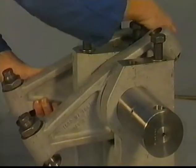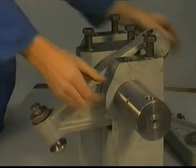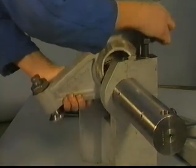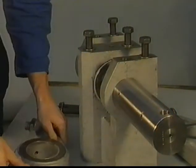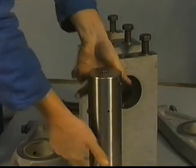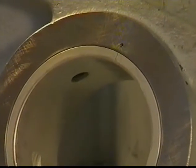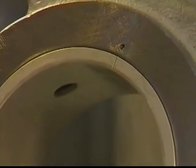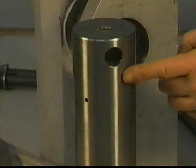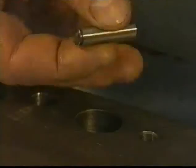To inspect the bearing bushes of the rocker arms, the shaft has to be removed. The shaft can only be mounted in one position due to the eccentric holes of the bracket bolts. The mark on the frozen-in bearing bush should correspond with the mark on the rocker arm. Carefully inspect the surface of the shaft for wear.